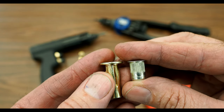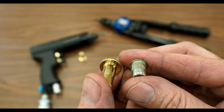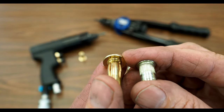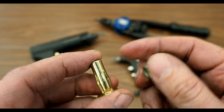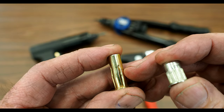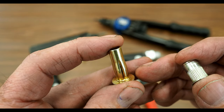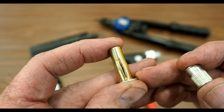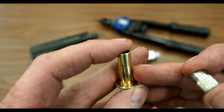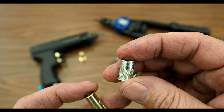You can see the shoulder or the head at the top is quite a bit thicker, and it's also a lot more surface area. So when you look at a RivetNut compared to a PlusNut, the RivetNut has a very small surface area where it's actually pinching and grabbing the sheet metal, where the PlusNut has a lot wider surface area and a lot thicker metal. On the back side, the PlusNut is also a lot longer. When you pull this down to set it with the tool, these little bars spread out in a Plus pattern and they expand to three-quarters of an inch, so you've got three-quarters grabbing on the back side of the sheet metal. You end up with a very secure connection. If you're going to hang any weight off of them or if they really need to be structural, a PlusNut is a lot better than a RivetNut.